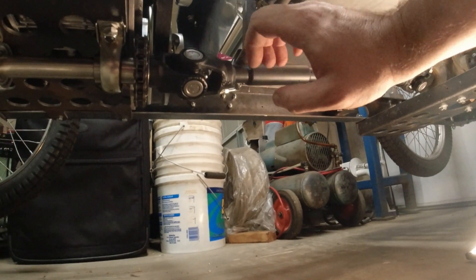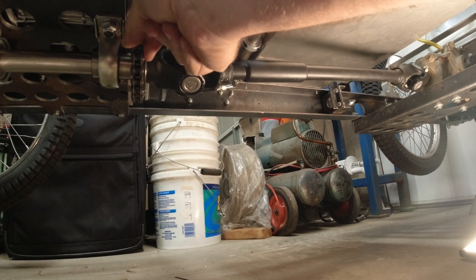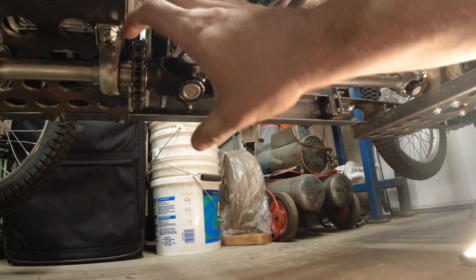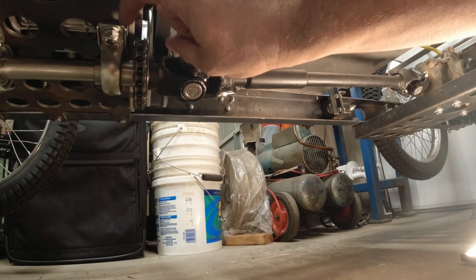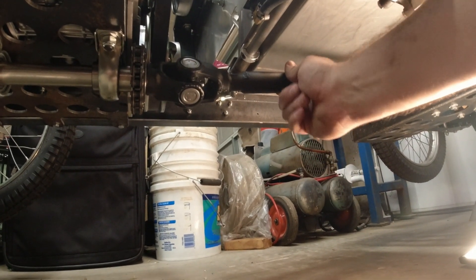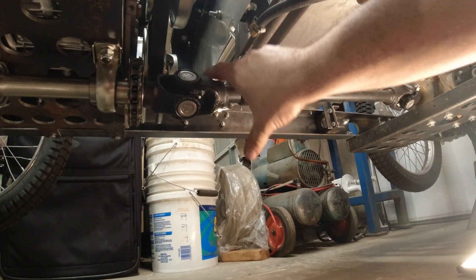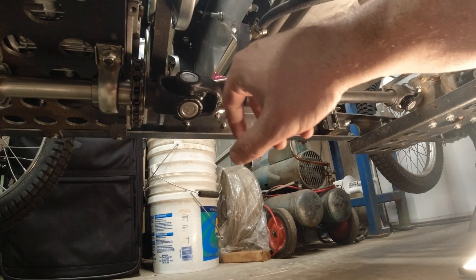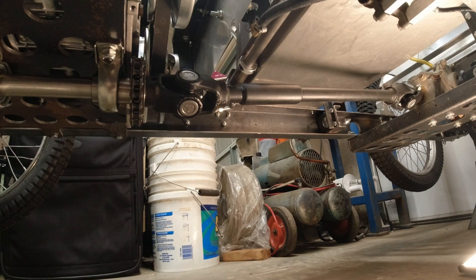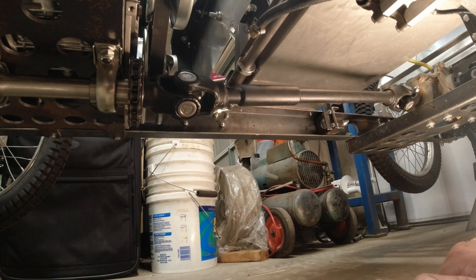Here's the underside of my drive shaft. You can see right here I can wobble it a fair amount. The sprocket is separate from the assembly — it's got a spline that attaches to the shaft, and the yoke also has a spline which attaches to the shaft. Really I've only got about an inch and a half of contact for both the yoke and the sprocket, and when this thing's running it's just wobbling all over the place. The plan is to replace it with the new jack shaft assembly. The new yoke is going to push it out farther too, so I won't run the risk of slinging grease up on the CVT belt. All in all, it's going to be a much better assembly, and we're looking forward to gaining the driveline efficiency back and getting up to about 45 — at least that's the goal.